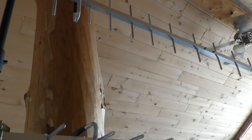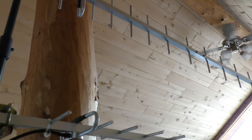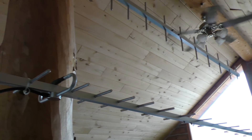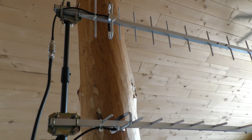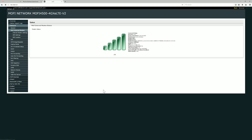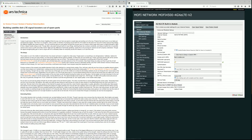Now you might wonder: what happens if you put one vertical or one horizontal, or put them both at 45 degrees like you're supposed to? I just don't have the equipment for the 45s, but I did play with these — I separated them at every distance the poles would allow and played in every position. You know what happens? You turn them like that and you don't get any LTE. It just screws the signal up.